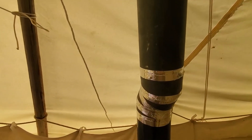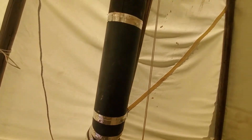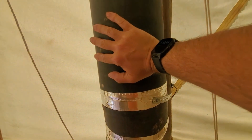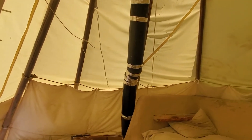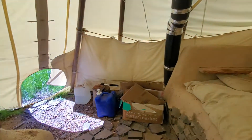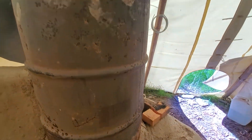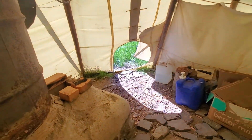Keep in mind this isn't a normal wood stove — there's no creosote building up in there that's going to catch fire and burn the whole place down. That chimney here rarely gets above body temperature; I have not felt it get above body temperature. It drafts just enough to pull fresh air in so the fire can stay going. The main change is that the exhaust goes up over here now instead of going down and over behind and then up — that makes a huge difference in how this thing draws. I was really pleased with how easy it was to start last night.